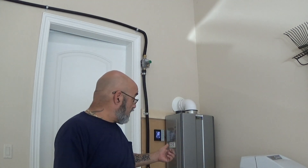Like my first video, most of our installs are in a garage in a customer's home where we remove a water heater and put in a tankless heater. On some of the larger units, like the RCU and the RCR98s, the 199,000, the RL9.4s, there's a problem with gas pressure. So you need to know what gas pressure you have.